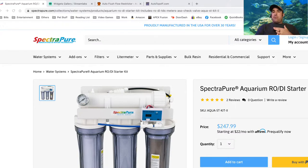It's going to give you the DI, which I think is extremely important. The carbon filter, of course, is extremely important. Sediment filter, not great and not really needed, but you're going to need it to get out the big stuff. So, of course, you need a sediment filter. And, of course, the fourth stage is the membrane. I think a four stage is the minimum. But to answer your question for everyone out there, the bigger the amount of stuff you have, the less maintenance. Okay.